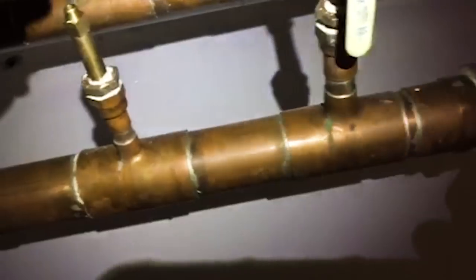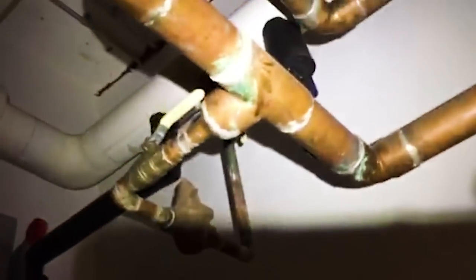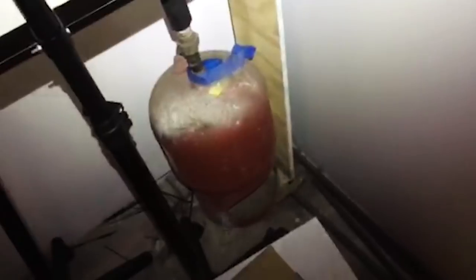These are those Pete's valve fittings. Got some thermometers — 90-something degrees in and probably about the same out. Chilled water piping, all the same fittings. Chilled water circ pump. Looks like we're getting makeup water for our chilled water right here from our closed loop, which is interesting. No expansion tank there. And we've got a normal water source air conditioner here — not quite as fancy. Y strainer, circuit setting valve, flexible hoses. You can see we've got ductwork leaving this one instead of chilled water piping.